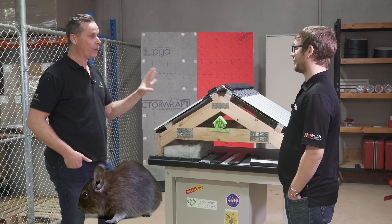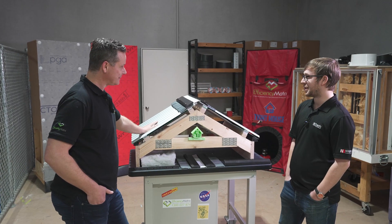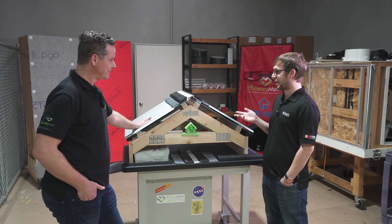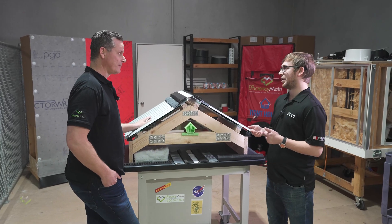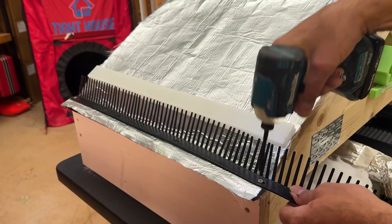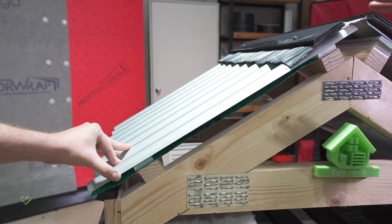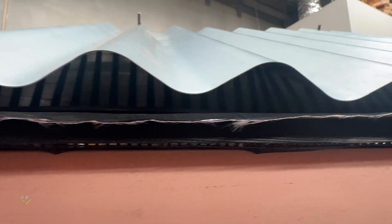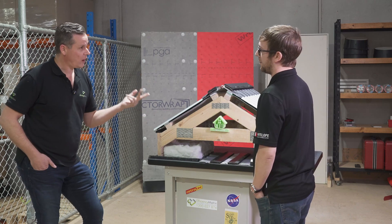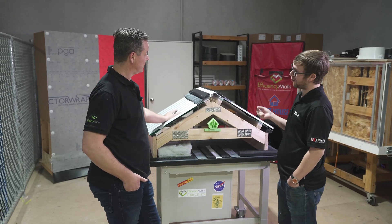Vermin getting into roofs is critical on all construction, but it probably happens most with roofs. If you're introducing openings into your roof, you can allow vermin, birds, or anything into the roof space. What we do have is an eaves comb filler — essentially a plastic strip with legs on it. You attach that above the sarking through and into the fascia vent, then when you bring the roof profile down over it, it pushes down those legs so it conforms to that shape. What you're left with is a grille that stops anything from getting up into those roof cavities — you've only got a few millimetres between each of the legs.